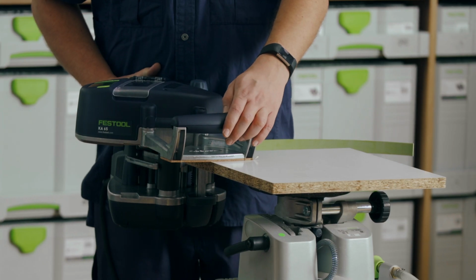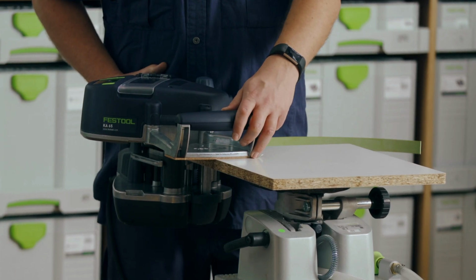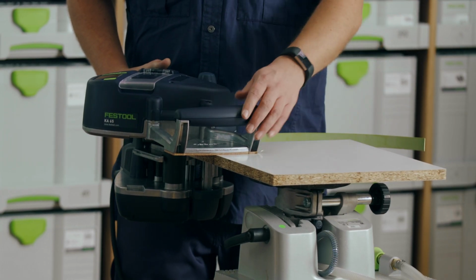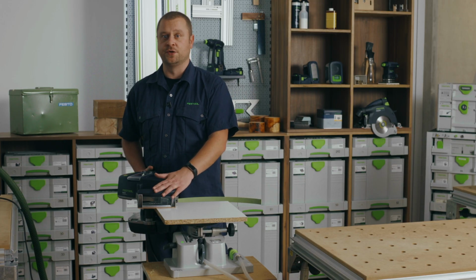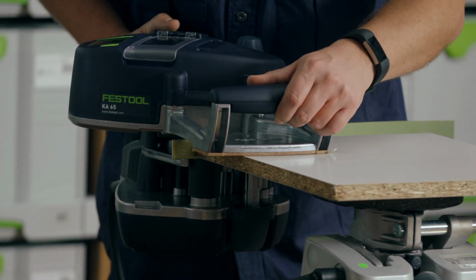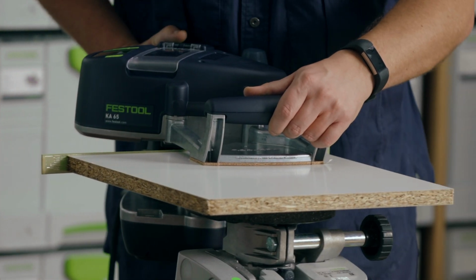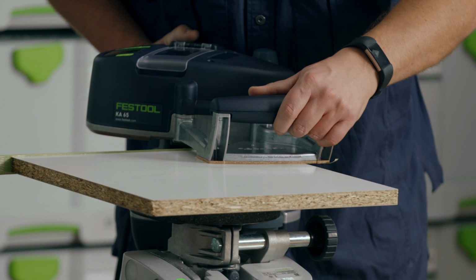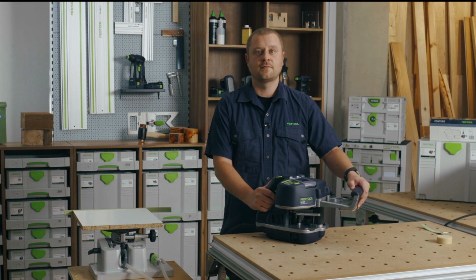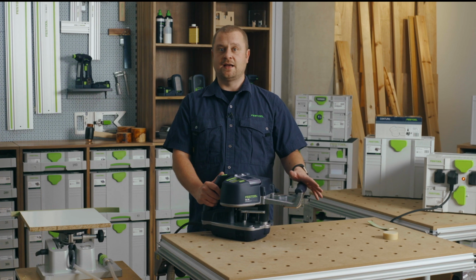As soon as the edging becomes visible to the right of the board, start the gluing process by applying firstly forward pressure so that the edging and board are contacted together, then instantly follow the feed rate of the CONTURO, maintaining a gentle, constant pressure against the board. The CONTURO will then automatically stop feeding and applying glue once the edging has passed through.